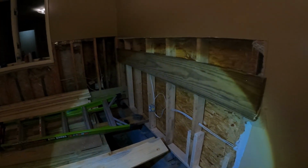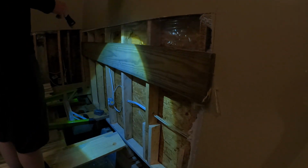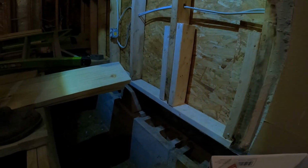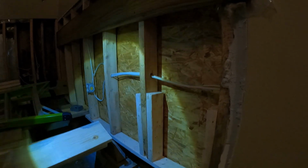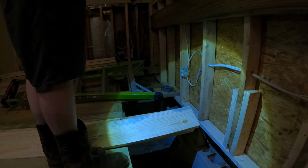We would go out there, but it's dark out. And then also we got some of the stress off of everything else. So these 2 blocks are actually holding weight right now. We used this board and a jack at the bottom and lifted this whole wall up like 1 inch to be able to put those boards on it. And then I braced it also, like this little board is screwed in, that board on the back is screwed in all the way. Like brace it all together. And then it's not high enough, but it's a lot higher and takes some stress off everything else.